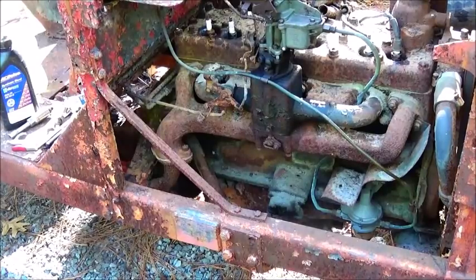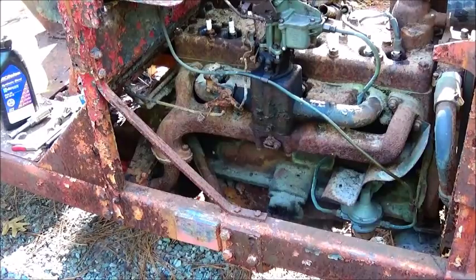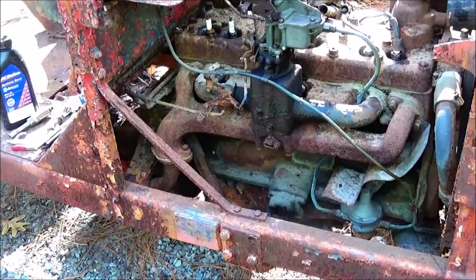Okay, folks, put some spray in it, put the plugs back in it so it could sit a while. I think what I'm going to do, I've got a sure way of, even with 60 PSI, getting this thing started, but it's going to take me getting these back wheels unlocked. Both the brakes and the wheels are locked up, and if we pull this thing off, we can get the engine to spin fast enough, it'll start up and run. Usually sitting that long is rough on them. So some of them run and some of them don't.